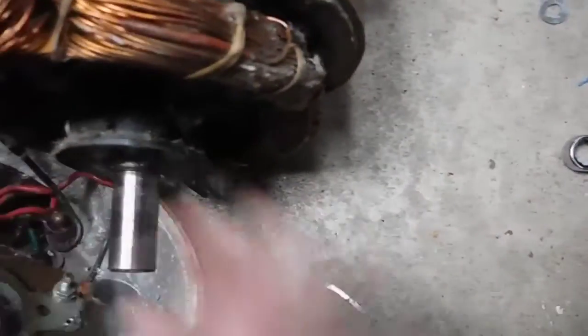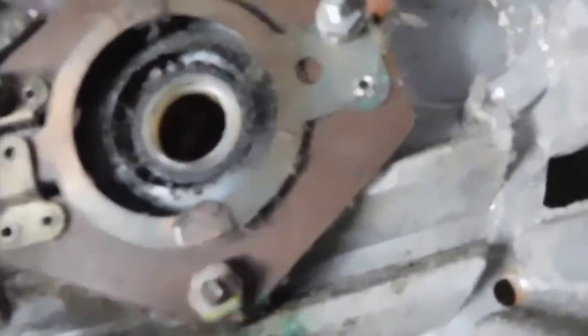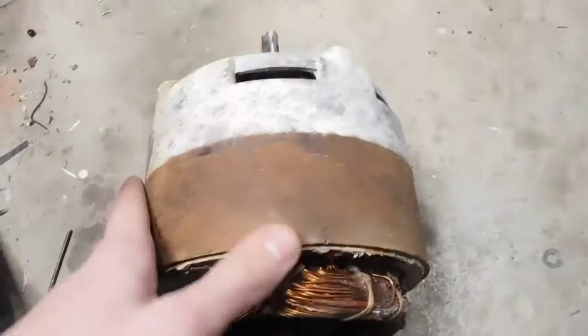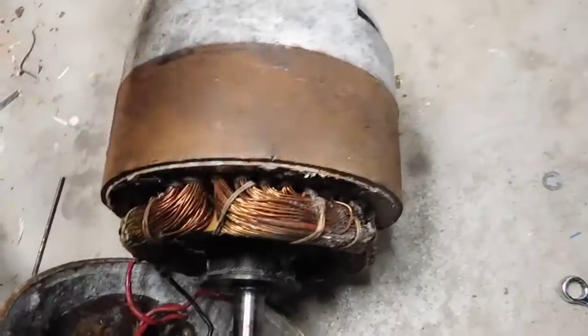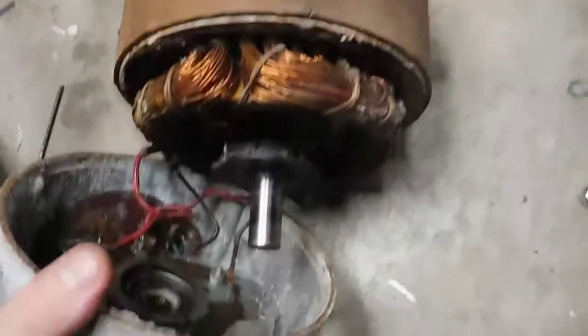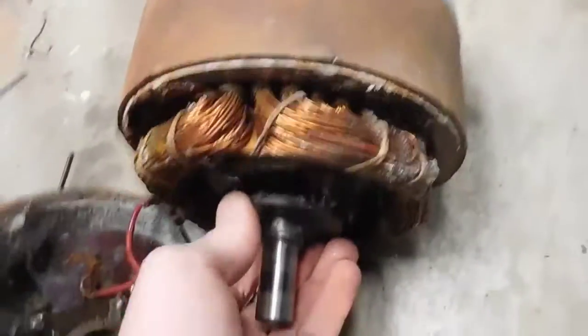There's a lot of dust on it, probably from it being used, but it's actually in really good nick — there's only a very mild amount of scoring on it. Same with the inside bronze sleeve, which you can see down inside there. This side on the outside looks alright. This must have been protected, but the front end's actually taken the most abuse. I'm going to probably belt the shaft with a block of wood and see if I can push it back in, then hopefully separate the rotor and stator from the end bell. It's not too bad — it's still seized — but the centrifugal switch still works, which is the important thing.